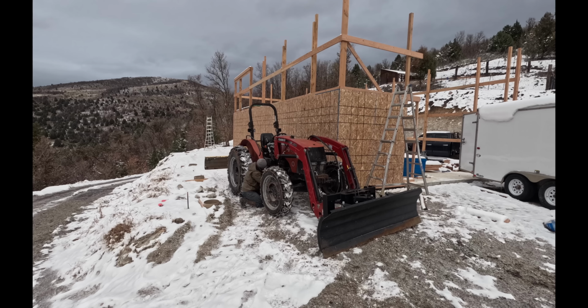This flashing goes along the top of that ledger board and down the face of it. The concrete here will be even with the top of that ledger board, or down maybe a quarter inch roughly. There will be a foam seal strip that goes on the face of this ledger board between it and the concrete, and that'll act as a break point as well as a little bit of an expansion joint, so that the slab does not press against the building directly.